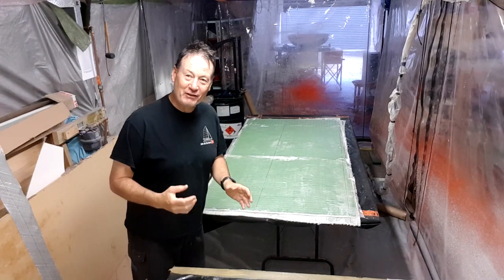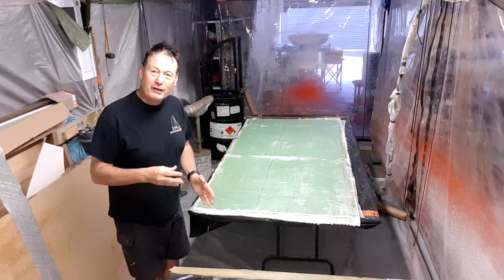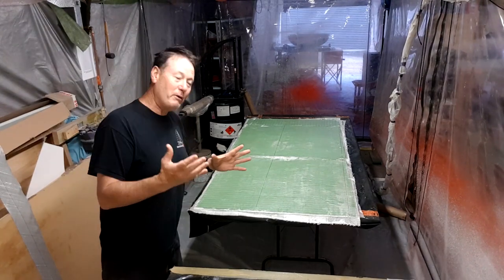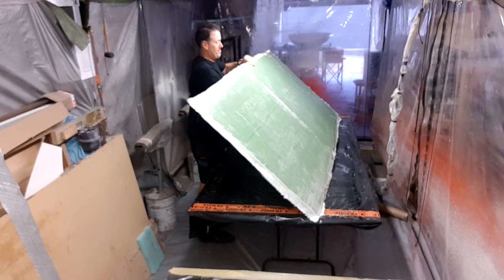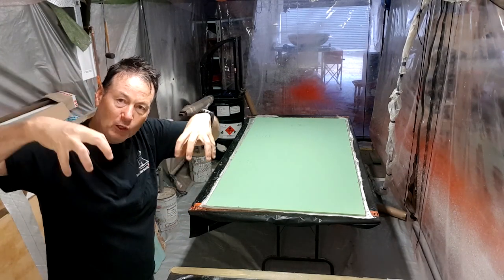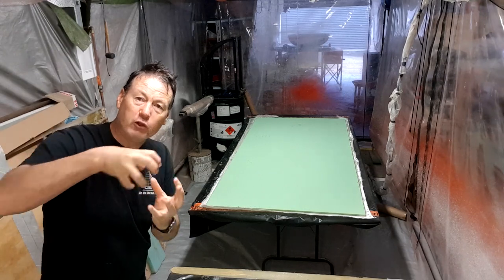It's the next morning. Given I started late yesterday because of the catalyst issue with my machine, having to service that entire pump system, this has now gone off and it's ready to roll over again. The important thing is while it's still green you don't want to distend or pull it out of shape, so when you're lifting it you try to lift it at all corners rather than just pick it up and bend it off the plastic below. You can see there's a lot of penetration through the perforation - it's very important that the perforation is filled with resin, as it enables claws from the matting down into the foam ensuring good penetration through the pores, almost like a rivet or claw arrangement that holds it in place.